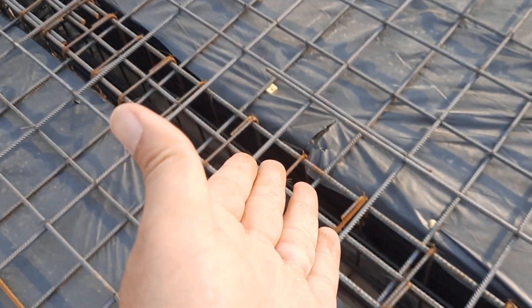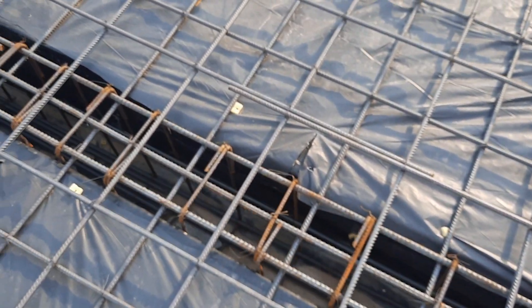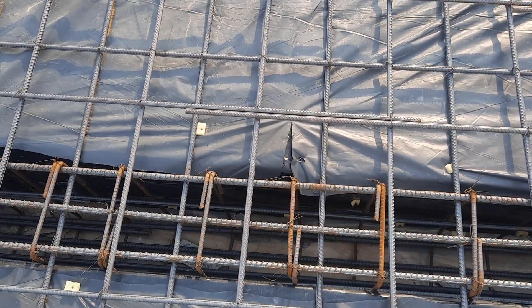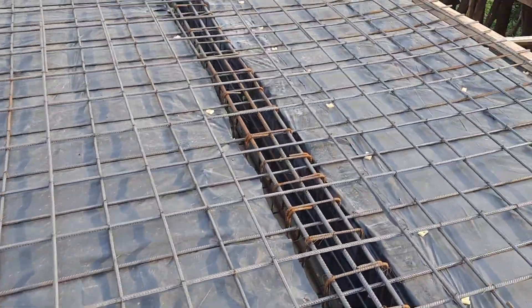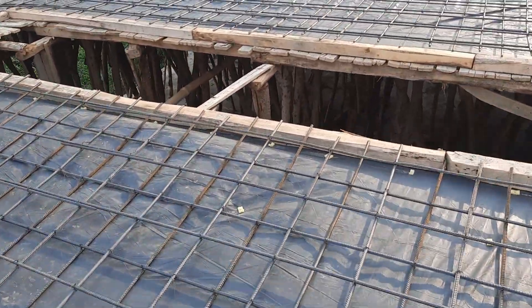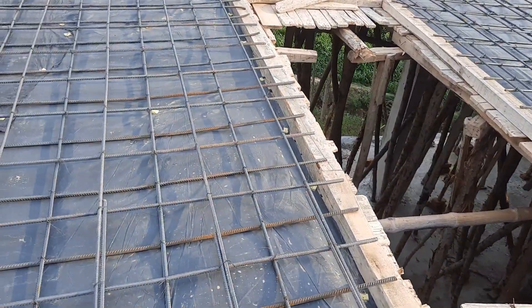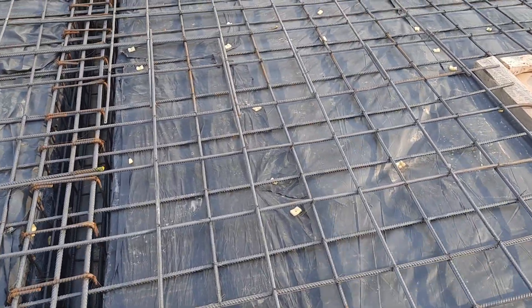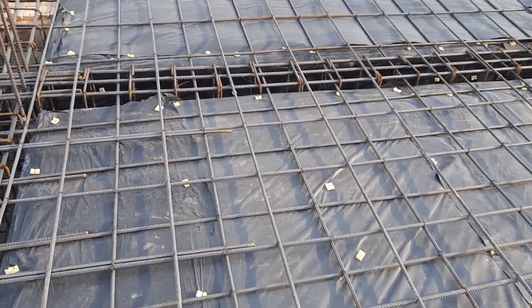You can see the beams. The size of this beam is 18 inches by 12 inches with concrete cover. This is open to sky because it is a commercial building. The steel reinforcement diameter is 12 millimeter, or half inch, with a spacing of 150 by 150 mm.